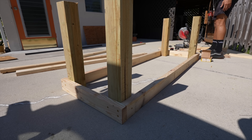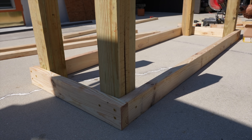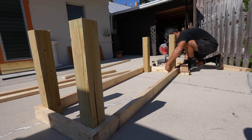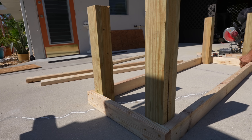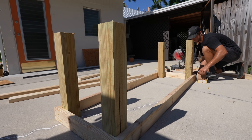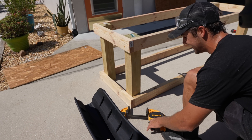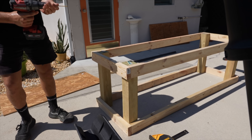Moving on to the next step, we are adding the uprights. We're using these four-by-fours to sit in the corner — we're going to be able to put a couple of screws in it, which should make it really sturdy. It's a little bit taller than I expected, even though it looks so short. The next thing we're going to do is make the frame that's going to be up on the top — it's going to be the same exact thing as the bottom. We got clamps and everything. This thing is going to be perfect. Dude, I think it's going to be really solid. It feels awesome right now. We just had to move that one beam over a little bit. We're chilling.